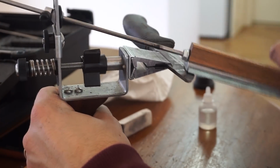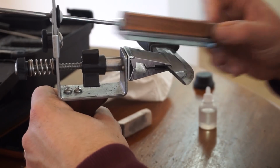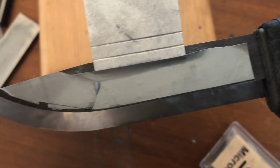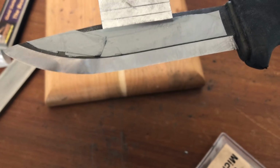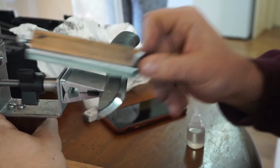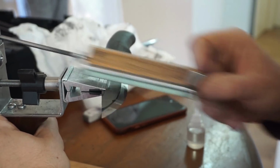After a whole lot of time, at about the 1 micron level, I started to notice a proper dark mirror or gray mirror, which is where you can see the reflection of yourself or of writing or whatever, but still just a darkness to it, like there's still enough of the visible scratches to be catching that light and making it less shiny. So work with the 0.5 and the 0.10, the 0.10 micron was what really got the mirror going. And so I polished away with those for a good long time.